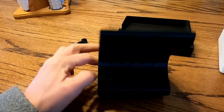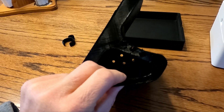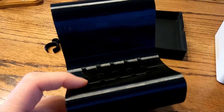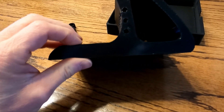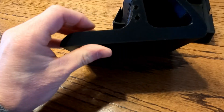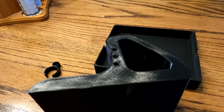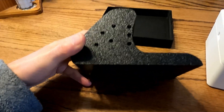This is the prototype elbow rest. I thought we need drain holes for sweat and ventilation — it was a nice idea, but it doesn't print very well in TPU. It causes what's called stringing because I didn't have my retraction settings quite right and I need to tweak the heat setting. Also, the drain holes create a quite stiff area due to the amount of material. I also discovered that this 95A TPU is a little stiffer than I expected, especially on the sides. So I can make the sides more thin, reduce the material in the upper area, and that'll make it lighter — right now it's 4.7 ounces and I'd like to get it down to at least 2.5.